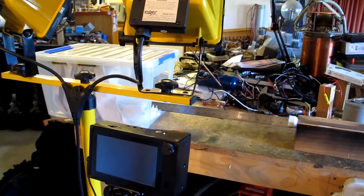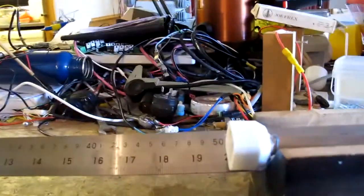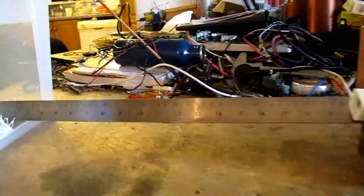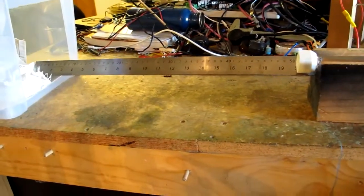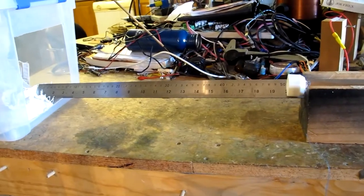That's a speed testing rig. I've got the Kronos here which will capture high-speed video and I've tried to line this up as close as I can with the 50cm mark. It's got about 5cm going in there, so the frame is pretty close to 450mm long. Based on the frame rate of the camera and the distance travelled, we should be able to get a good idea of how fast it's going.